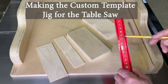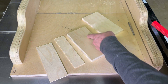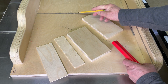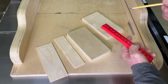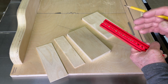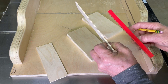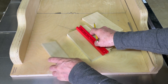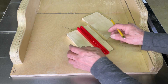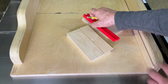We're going to use the little tenon on the back of our template to keep everything straight and centered. In order to do that, I need to have a groove in the bottom piece of my jig, and I can set up the table saw to cut it. But unfortunately, this is about a 32nd of an inch over the kerf of my table saw blade. So rather than moving it back and forth, I'm going to use a couple of pieces of thin material — this is eighth-inch Baltic ply — and I'll just locate that and squeeze those together, and that will form the groove I need to capture the tenon for my template.